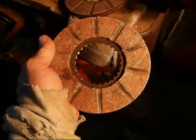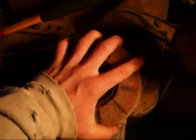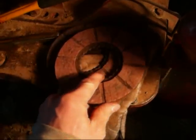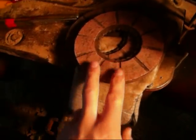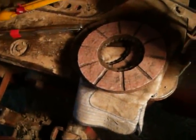These weren't worn out — they were just glazed real bad. I tried deglazing them by putting one under each palm and running down the blacktop road, turning them and rubbing them along the pavement to rough them up. I'm just going to try putting them back in and see if they last. You've also got to make sure there's no little dam left at the end so they can actually vent, and dirt and dust can be evacuated.